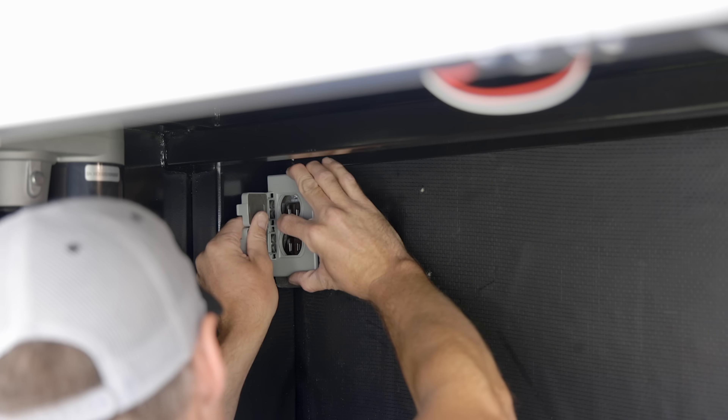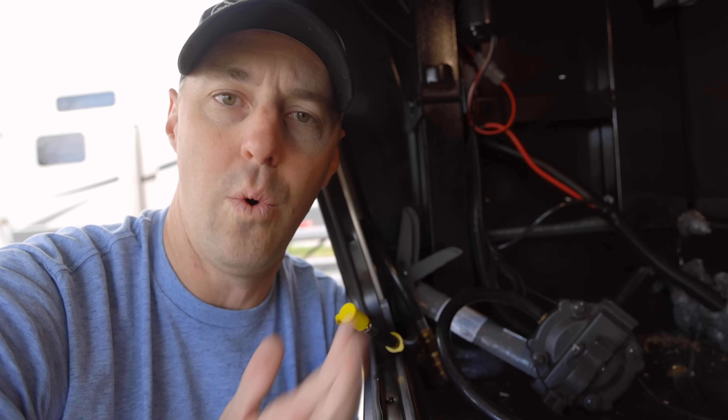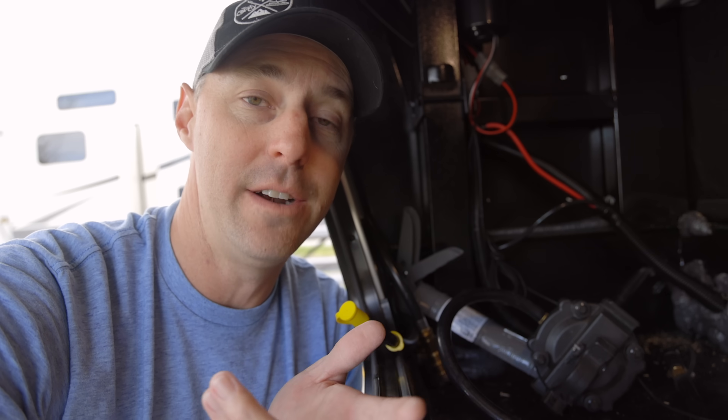This outlet was a little easier to wire since it's at the end of the line with only one wire coming in. The one we have to make up now would max out the amount of wires going into that box, so I'm going to put in a small junction box for the wires that were originally going in there, tie those back in, and feed this box — that saves space and allows me to make those connections in the junction box.